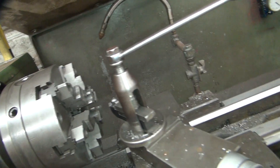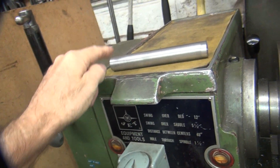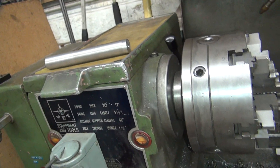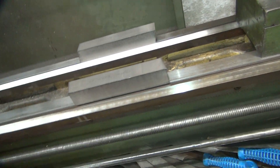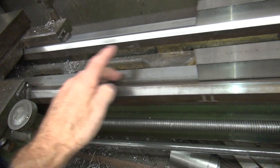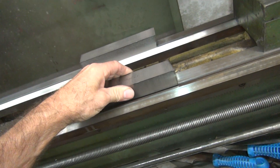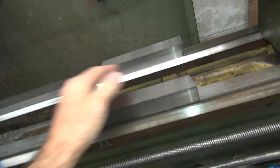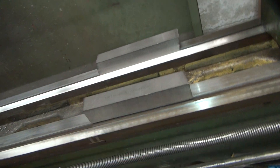I had — I think it was like one and three-quarter thou between here and here when I measured it. So that's my error. What I did: I cleaned everything off, stoned the surface, stoned my two blocks here. These are big tool bits — I use them for all kinds of stuff except tool bits. They are within one and a half thou of each other all over. Total reading.